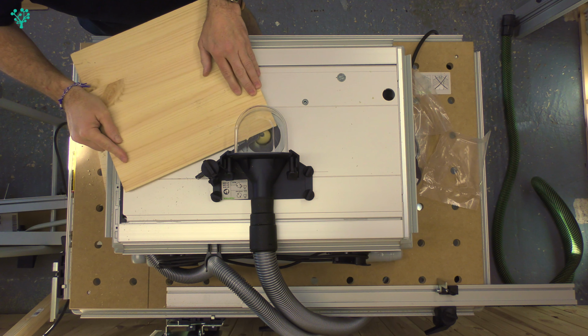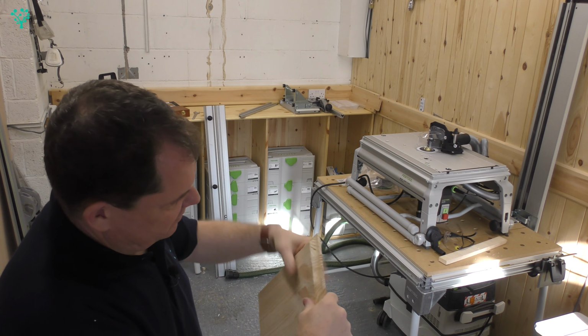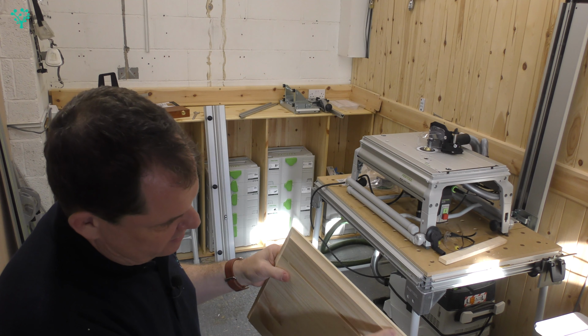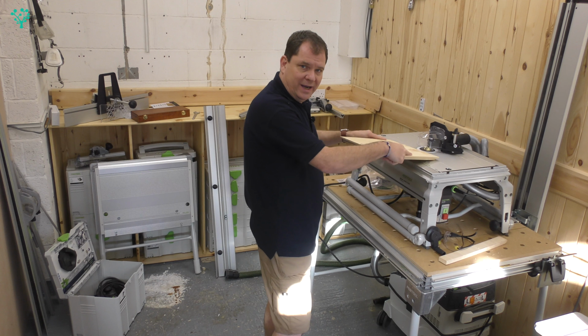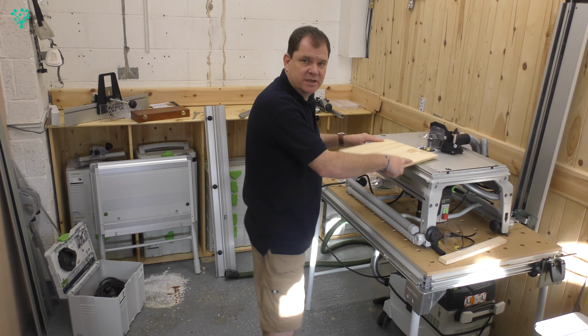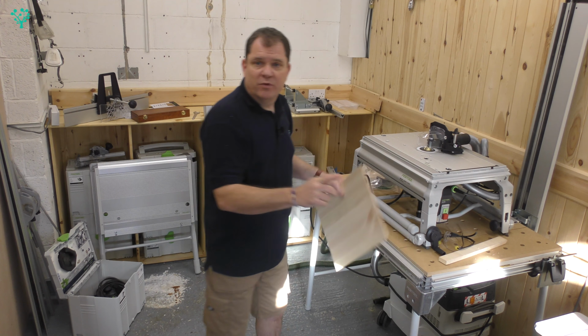And that was painless and results pretty good. We have a nice chamfered edge across here, or whatever you would call that. Yeah, bit of practice, but they're really nice joints. What I did find is that obviously you need to keep this flat to the table, and as I started to get to this end, because I don't have that wide area to rest my panel on, that can tend to tip. But we have a solution for that, and that solution is an extension table.